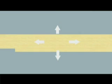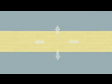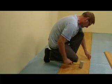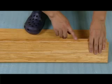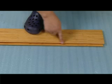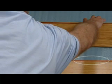Start installing the floor on one corner, from left to right, or from the middle of the area. Always remember that the easiest way of installing the Tap&Go floor is positioning the up hook into the low hook. To realize this, please always have the low hook edges in front of you during installation. In these installation instructions, we will begin with installing Tap&Go floor in the left-hand corner.